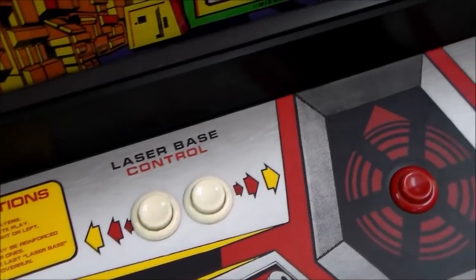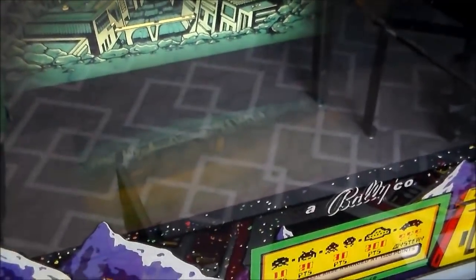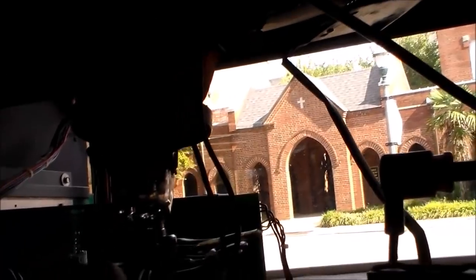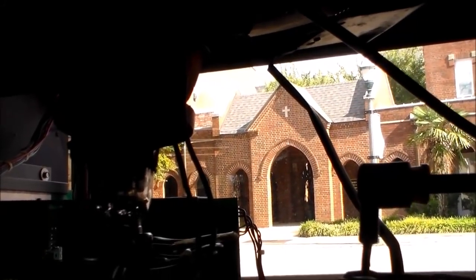That didn't sound good, did it? Our light is on. It's making a bunch of noise. Doesn't sound that great. Let's see if we get anything on the monitor. These monitors take a little while to come up and do their thing. Oh, I think our monitor's messed up. I don't see any neck glow on it. Normally that neck should be glowing orange, and it's not, and things look a little crooked. It may be that the tube is screwed up.